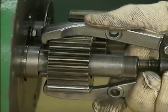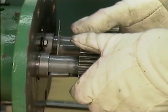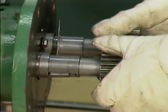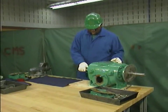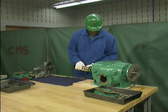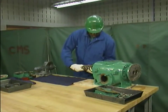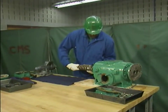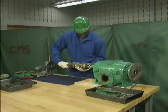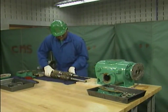The timing gears are removed the rest of the way by hand and put in the parts pan. To protect the rotors during their removal, the mechanic follows three basic guidelines. First, he pulls the rotors out of the casing together. Second, he holds the rotors firmly together as they slide out of the casing to keep them from shifting. And third, he makes sure that the rotors are adequately supported until he sets them down.